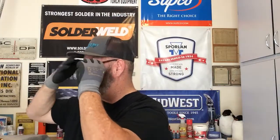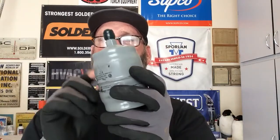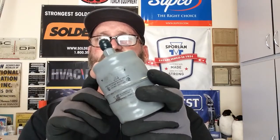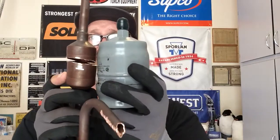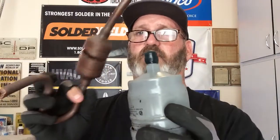This is called the muffler. Now the muffler does not want to be confused with a dryer. This is a liquid line dryer from Sporlan - it's a little bit bigger, but you can get these in an 083 dryer with sweats, and honestly an 083 or maybe a 053 would be just about the same size. You want to make sure that you don't put a dryer in the place of a muffler.